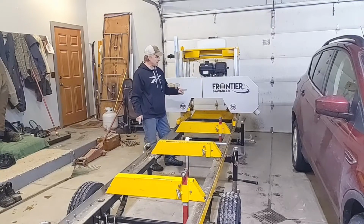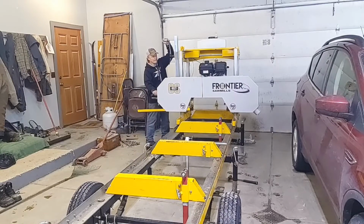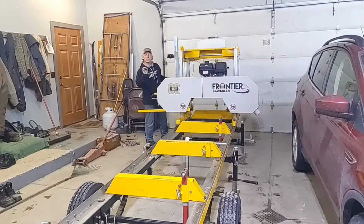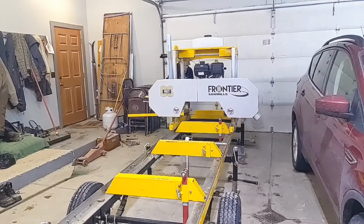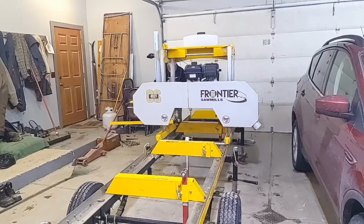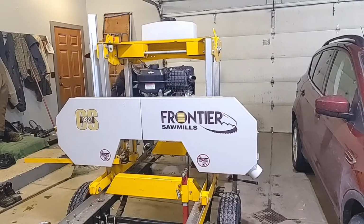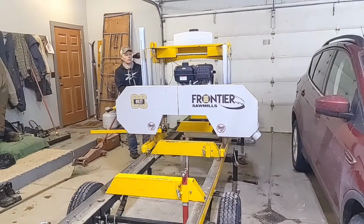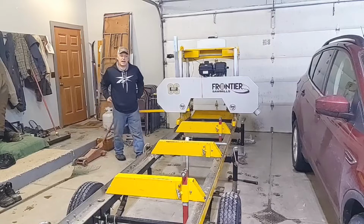So now I'm going to check each detent and make sure we're good. Pretty sure we are, as long as it passes on number 4. So if I go to 4 inches, right at 4 inches, I designed these, I think I have a 1/4 inch of clearance. If it crashes, you'll watch it happen live. Nice. So that's all good. That's 4. So I know I'm safe at 4 to not hit these.